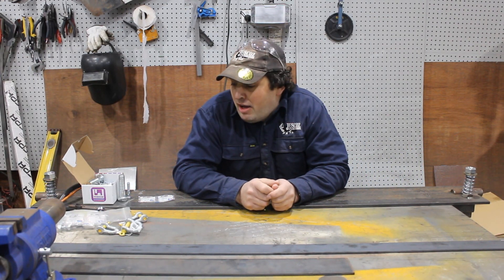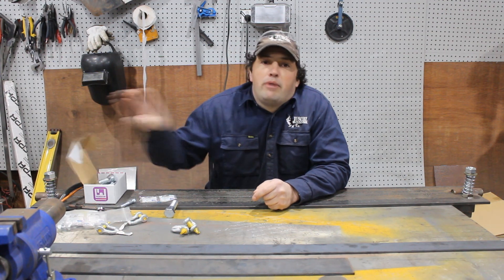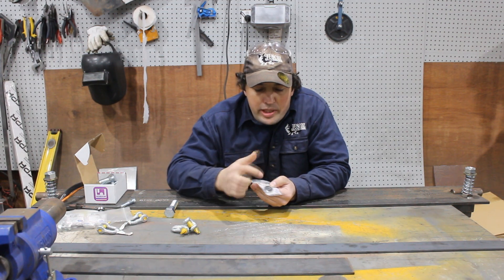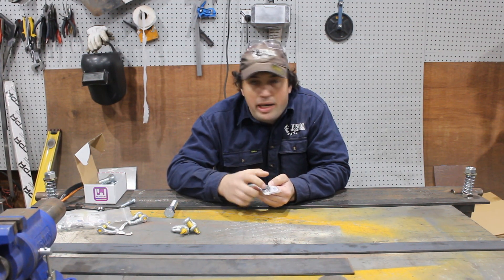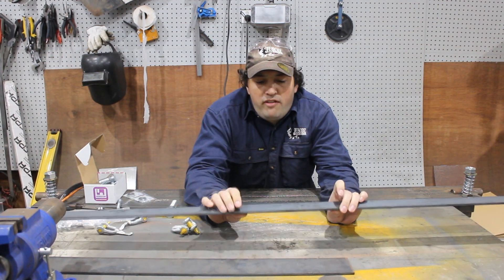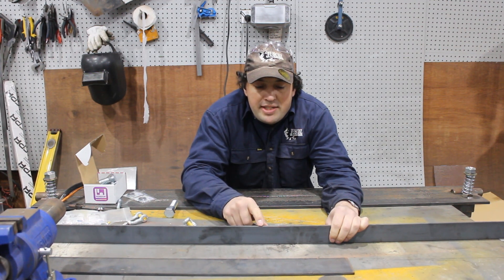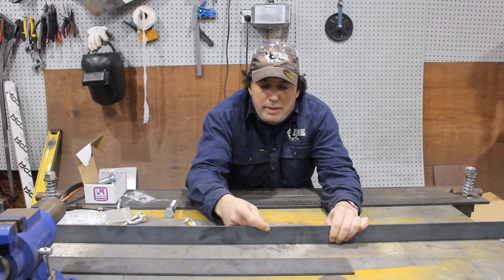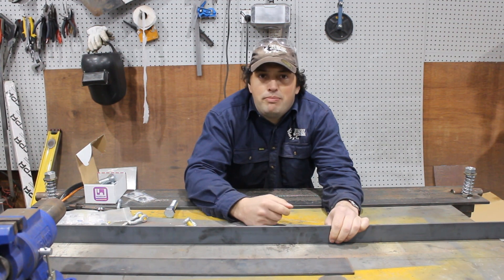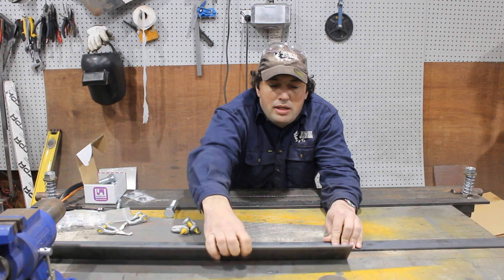So, I've been shopping. I've bought some D-shackles, a box full of bolts — we're not using all of them on this project. I've got some bearings, they're 26mm OD, 10mm ID. And I've got 50x6 flat bar. Now, for this particular project, I would not go anything less than that, because the 6mm is the bit that's going to give you the troubles if anything. So, 6mm minimum. And some 75x6.